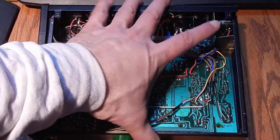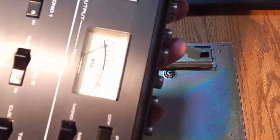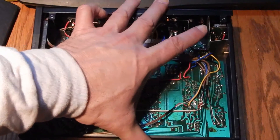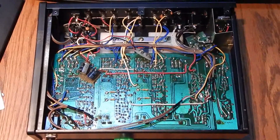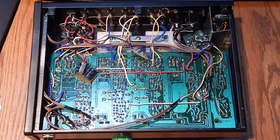Well I didn't get the front off. I can't get these knobs off very easily - I hate to force it and break the slide pots. I was putting a lot of force on them and I couldn't get any of them to go. It's almost like they're glued on or something. So rather than risk breaking it at this point, I'm going to see if I can get hold of the schematic otherwise. Of course if I ever wanted to change a nice op-amp or something, I'd have to pull those pots out anyway - but they're not coming off, they're glued on hard.